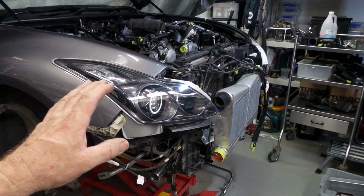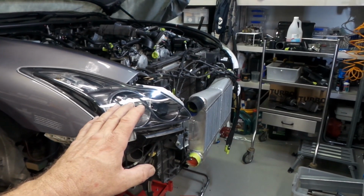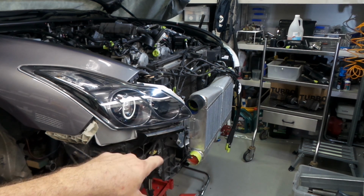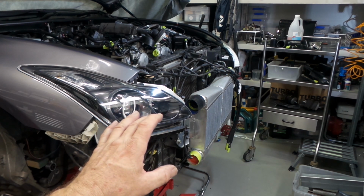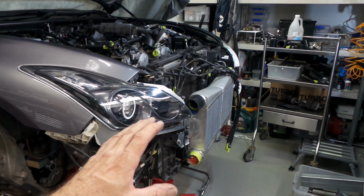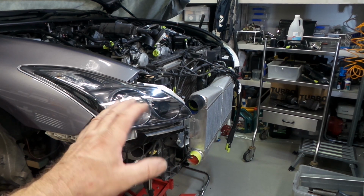I've got a little bit of thinking to do on how I'm going to move forward with joining all the piping up to the intercooler and everything. I have a little bit of work to do on the intercooler. I'm going to slightly modify the brackets that I made a couple of years ago on this setup. I'd like to rubber mount the intercooler. The brackets just mount to the chassis, and then the intercooler solid mounts to the brackets that I made, which is the way that most of the commercial companies who do intercoolers on these things for the turbo kits in the US run them. However, I would like to rubber mount it. I'm a little bit concerned about having something tied between the two front chassis rails and the vehicle flexing and, you know, fatiguing the intercooler or fatiguing the brackets.